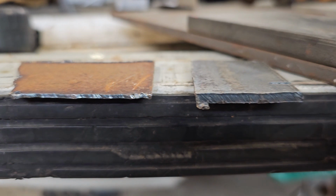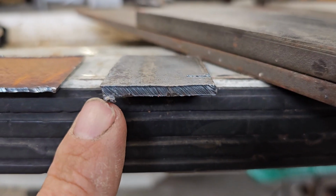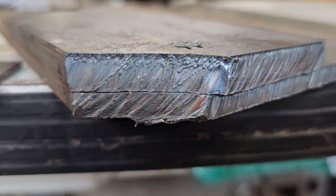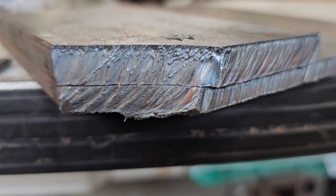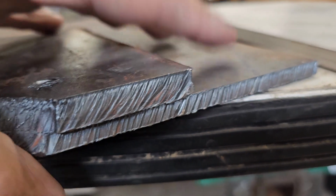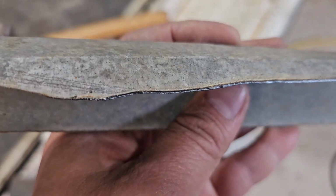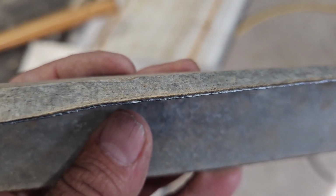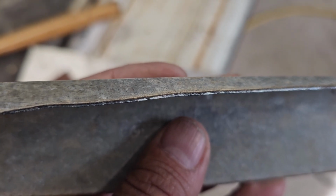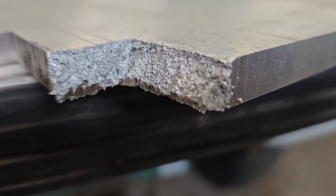So there you have it. I tapped the slag off. That's where I couldn't get it because my vice grip was in the way. There's a 5/8 cut all the way through. I knocked some of the slag off. I didn't get it all. Here's the two separate cuts. Almost forgot my little piece of tin here. It's the first one I did. It's like 22, 24 gauge. Cuts that like butter. And there's the aluminum.